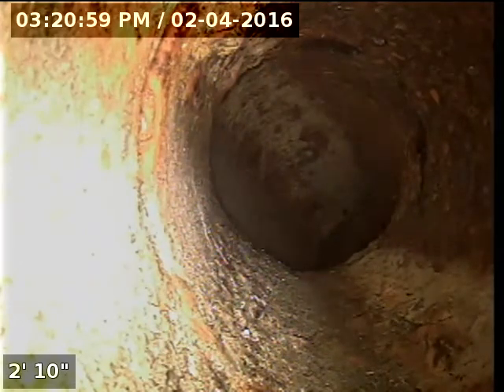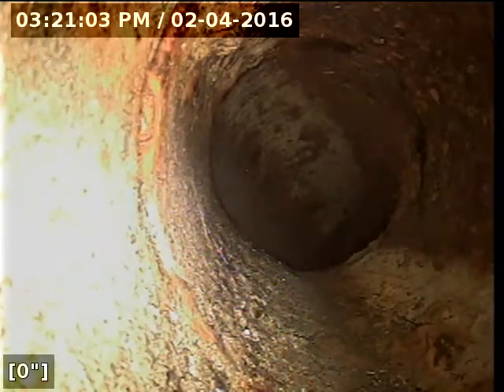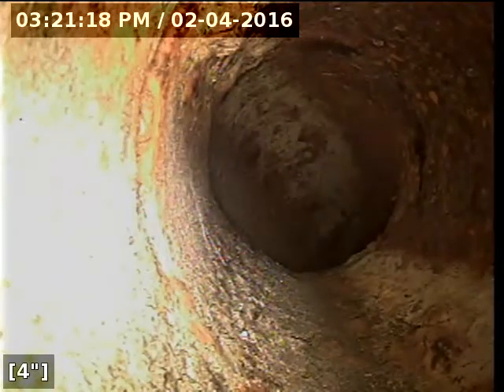I do have water running. I've got the sink and tub upstairs running currently. Throughout the cast iron here so far on the sidewalls, there's about an inch of debris buildup in a lot of these spots, which is not terribly uncommon. Cast iron is rough, very porous, and it catches stuff easily. If you have a habit of putting grease and things down the line that really shouldn't go there, they will really get stuck in cast iron. We'll look at that better on the way back out.